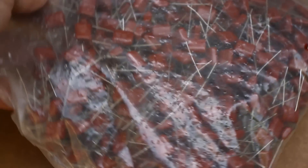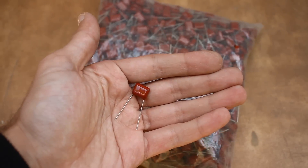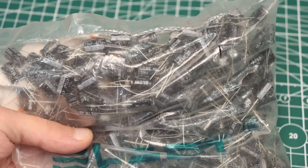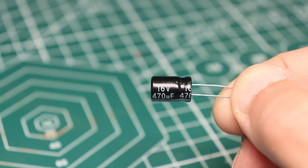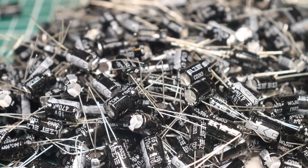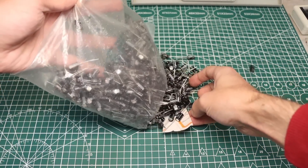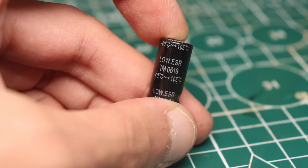There were two bags of film capacitors, 630V, 47nF. Based on them I wanted to assemble a large battery for the resonant circuit of the induction heater, so I don't touch them for now. In another package are 500 electrolytic capacitors of 470μF, 16V. I'm fond of pulse sources, but there is rarely a need for just such capacitors. They have a small capacitance, it doesn't make sense to use them in the output part of impulse blocks, especially powerful ones. There are only 16V — even in my 12V sources I almost always put capacitors with a double margin at 25V. And for power sources you need low ESR capacitors, but these aren't like that, so they lay for now.